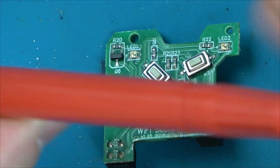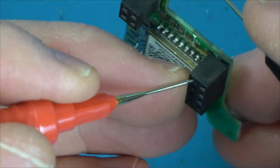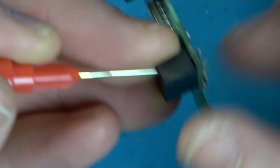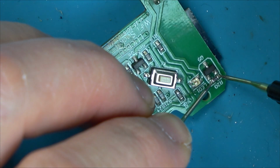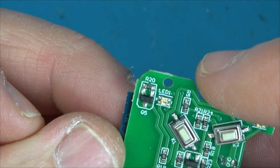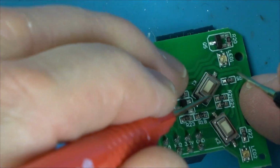I'm just going to test the resistors. Oh, also I just want to check, well, we know we've got continuity, don't we? Let's just make sure we have got continuity on that last one to here. Yeah. Yeah, the connection's okay. Right, 700 ohms, what should it be? It's 103, so that should be 10,000. But it's because it's over here, you see, so it's going to measure different. So again, this should be 10,000.